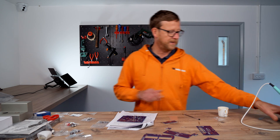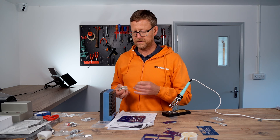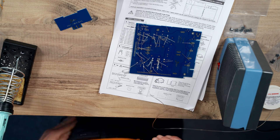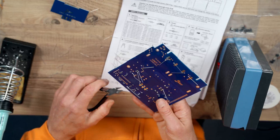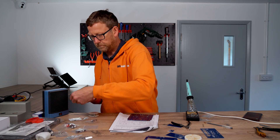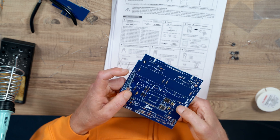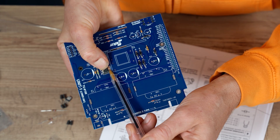I'm going to solder these in now. I'm using the Mundorf 3.8% silver solder — brilliant stuff. Bombing around the board. On number three, which is the FET, there is an orientation to them. Pop them through the hole and then fold them back. You can see that the top part is soldered onto the solder pad — you basically press it down and solder there. Quite straightforward.